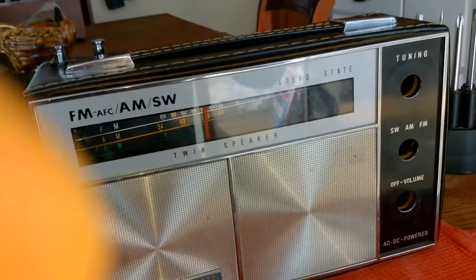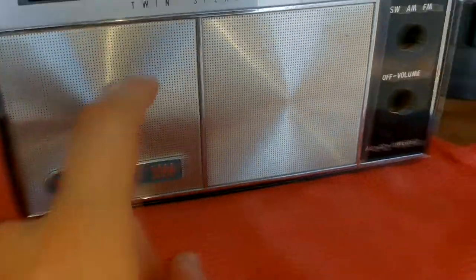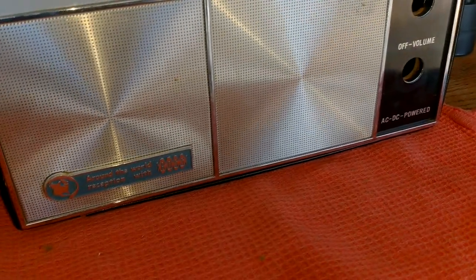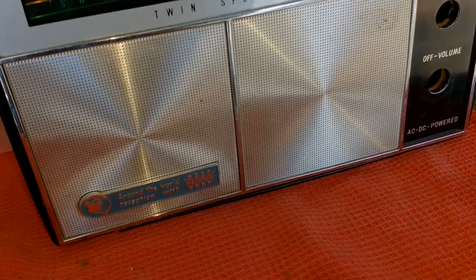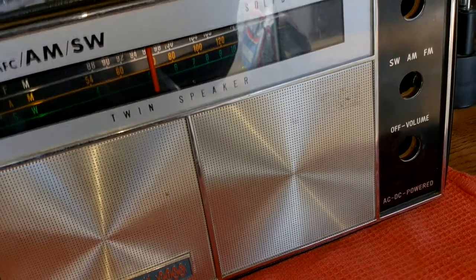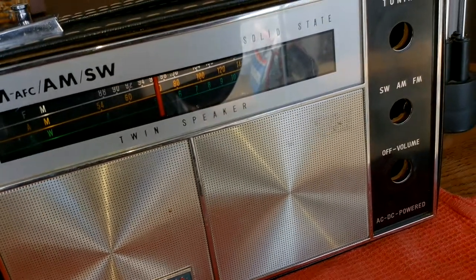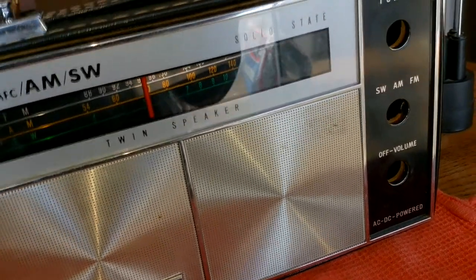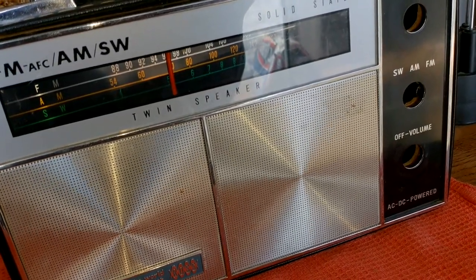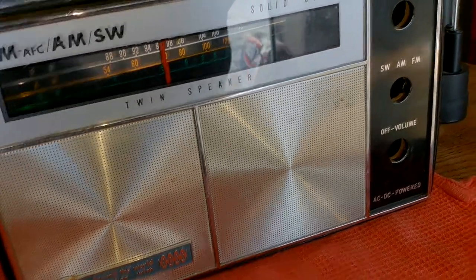Now here is the shame one — the Ross AM/FM AFC radio, which performs really badly. This is the symptoms of bad capacitors. It had high levels of distortion, which capacitors do. It had high levels of everything: low volume, weak station reception on AM/FM, and a sinusoidal waveform — but it was working. The stages were working. It's not a transistor issue because you could perceive stations. It just came in really weak and the AFC wasn't working good. This one is made in Japan.